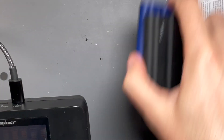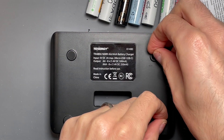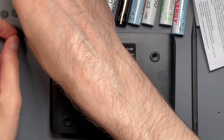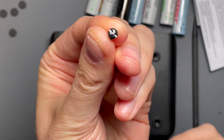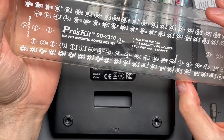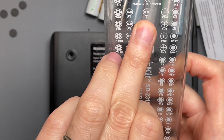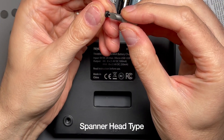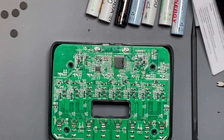Now we're going to open it up. There are these little feet on the bottom — I removed all of them — and then what meets you after removing those feet are the weirdest screws I've seen. They are a weird slotted screw head, and I have a ProKit SD2310 with a specific bit that fits. I'll put the bit type in the description below. Got all the screws out — never seen that type before, so interesting.